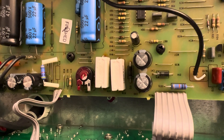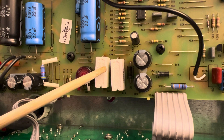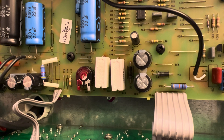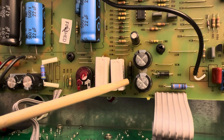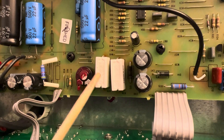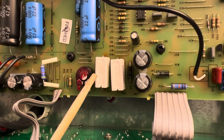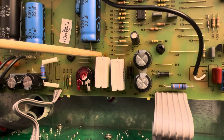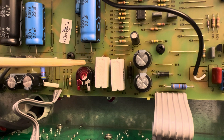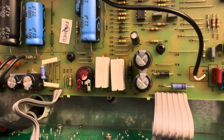What typically happens is there's a lot of heat being dissipated here. These are knocking down voltage from the transformer, and by the time it comes out of these diodes, you'll get a plus and minus 16-volt tap respectively. A lot of heat is being shed by these two components. The small pads are overwhelmed, they eventually char and lift, and then you lose connectivity — so your plus or minus 16-volt rail will go down.